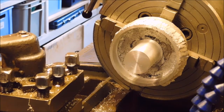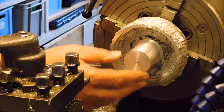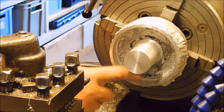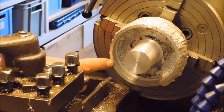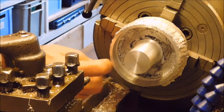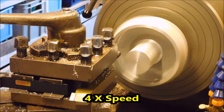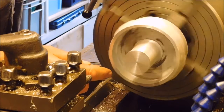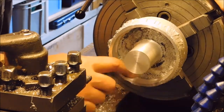Now I've cleaned up the center hub here. It's not a very nice surface but never mind that. I nearly cleaned up on the inner diameter of the rim out here. I think I'll take a millimeter or more. There's still room enough to get a nice surface on the outer diameter, so I'll take a little more on the inner diameter here. There's still room enough. Very nice.